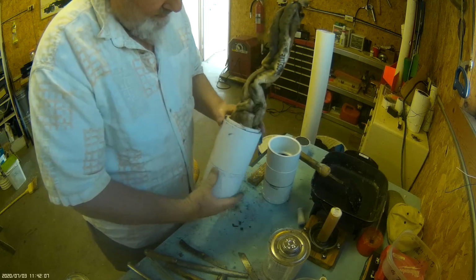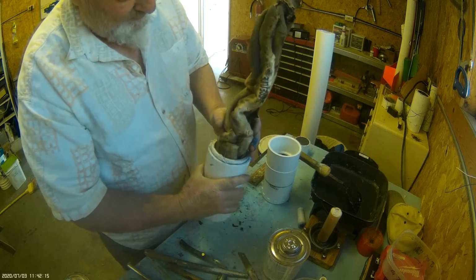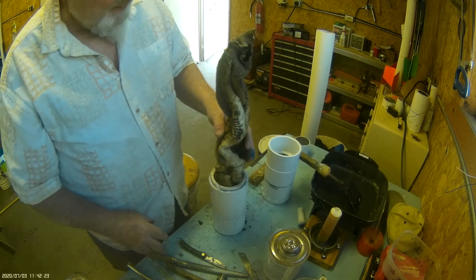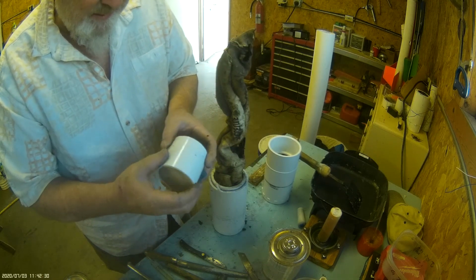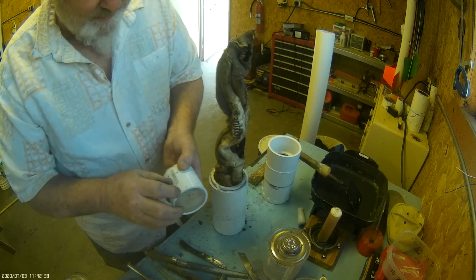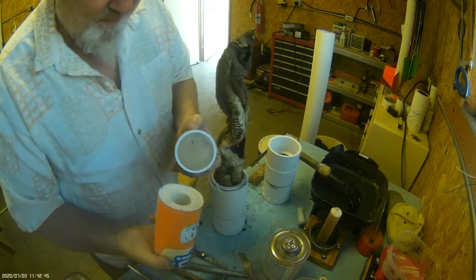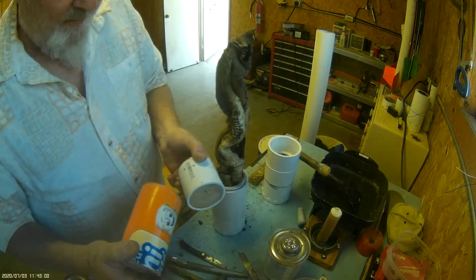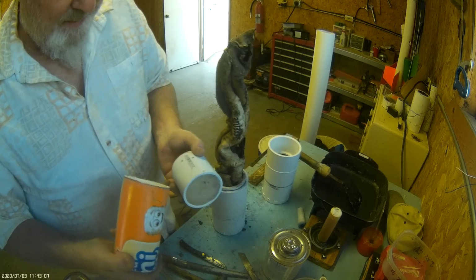And this could have happened after the fuel had burned and the motor has lost pressure, and because I have a 15-second smoke grain, which this is right here. It's made out of a 2-inch coupling, and it's got 3/4 of an inch of fuel, because that's the thickness of the web of the grain. So that part burns at 3/10 inch per second. And after it loses pressure, it burns at 1/10 of an inch per second.